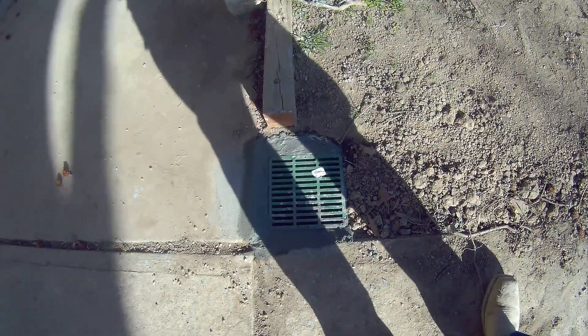So there are your three drainage quick tips. On the last one, feel free to make fun of my concrete work — I am not a concrete guy. The important thing is to ensure that the water flows into the catch basin. I've seen a lot of guys tilt them or offset them from the driveway or walkway, and you just can't pack the dirt in that small space well enough. Over time it gets worked out and the water isn't flowing into the catch basin. Hope you found these three quick tips useful.